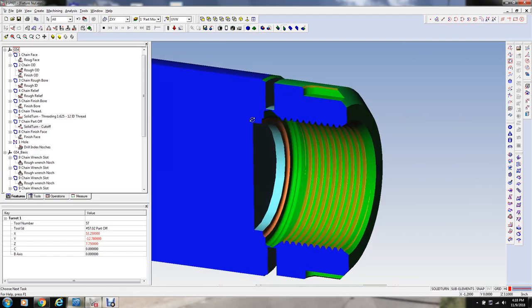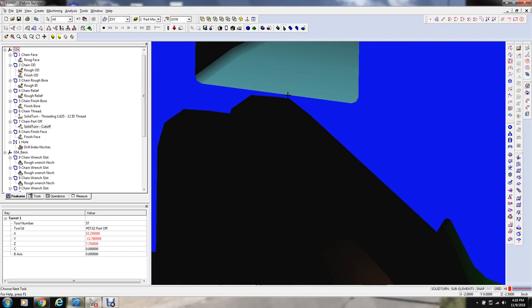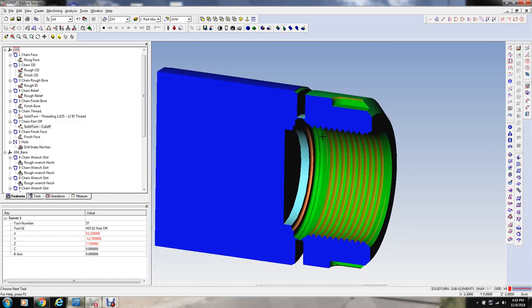And I might have to adjust that. If that should be 15 thousandths on the diameter, so it should be about 7-8 thousandths thickness there, which I should be able to break off by hitting it with the hammer.